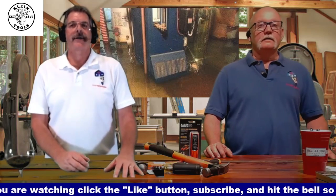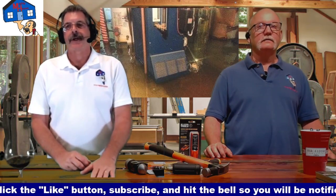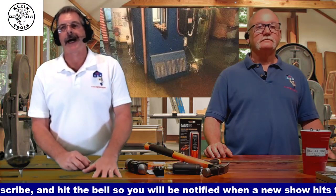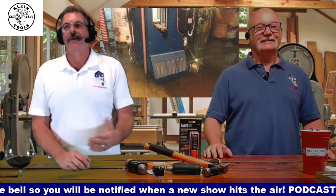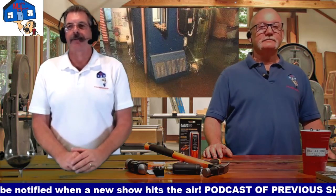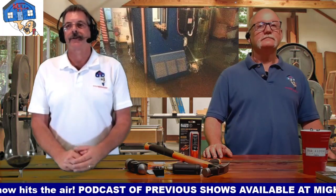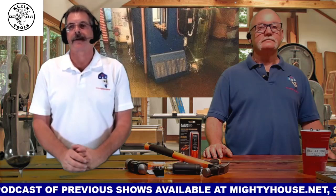Where you see them mounted higher is in areas like where I live, where we have what we call base flood, and that's hurricane. We figure the worst storm surge we'd have is 11 foot, so my base flood might be 11 foot. The bottom of my water heater has to be at 12 foot above sea level, so that I'm 1 foot above base flood. That's why if you walk in my garage, my water heater is sitting on a 2.5 foot tall stand. That puts me a foot above base flood, so my insurance covers it, and it should never be underwater.